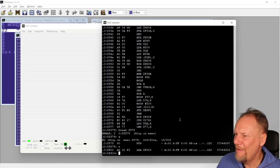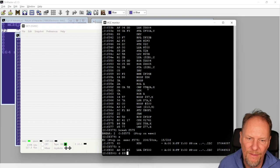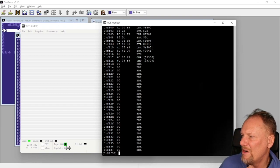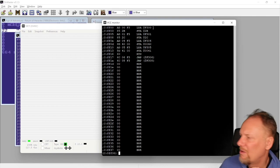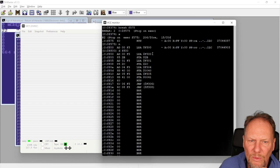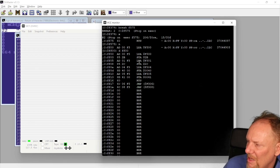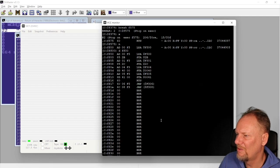Yes, and now we are on FF00. We'll do the disassembly of FF00. What it's doing here is setting up pointers. It picks something from F300 and F301, and then F304 and F305. These are setting up source and destination pointers to something it will copy down to the lower memory. Basically, it's taking from F576 and storing it to 08D4. Trust me, if you want to look at it, please do, but that's what it's doing here.